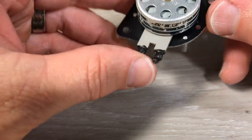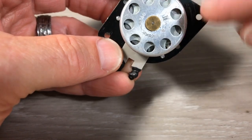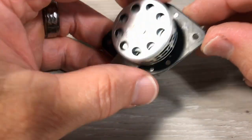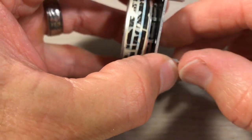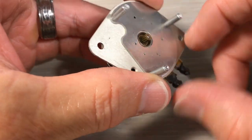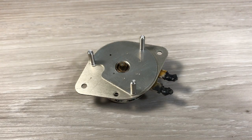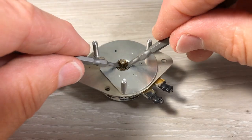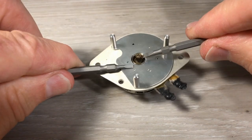This is a motor I've taken off a clock and I'm going to destroy it for your benefit. You can see there's a lot going on in there, but right in the middle there's an axle. We tell you to drop oil down there to get to that axle, and I'm going to show you why that's the only thing that's going to work. This is the gear on the other side — you don't often get to see that because there's usually a gear case there. This one happens to have the gear case off, and we're going to remove this brass gear to get access to the motor, which will help you see more closely how these motors work.